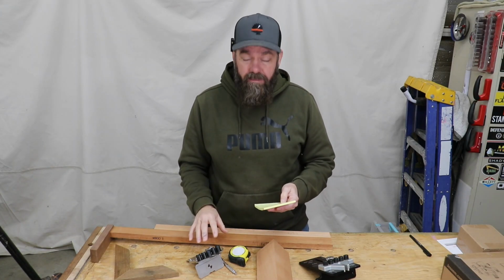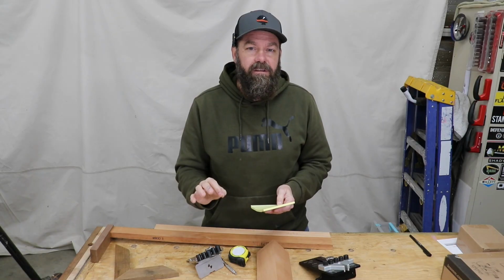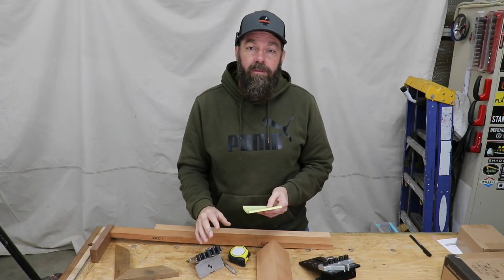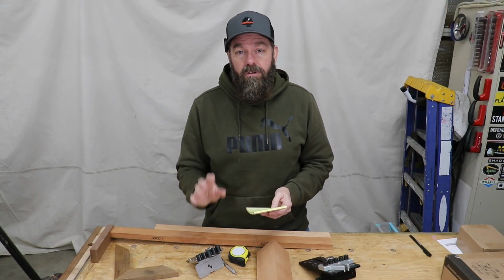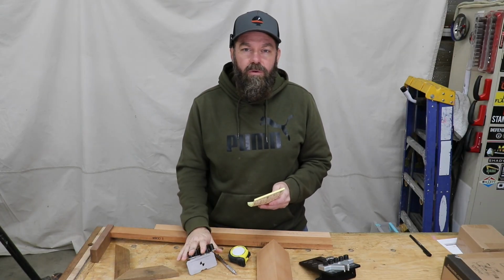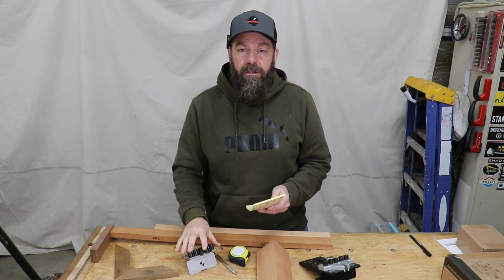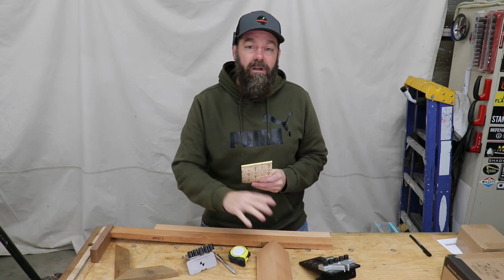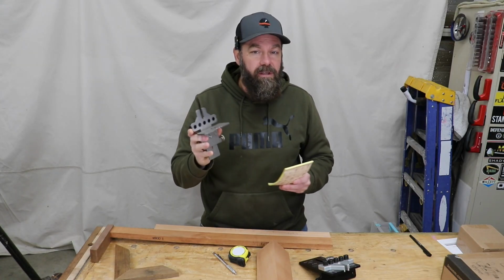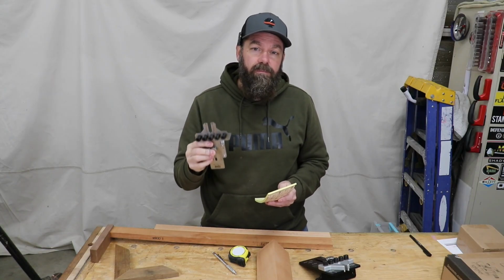As far as adjustment, it's pretty much a wash as far as doing it, but the new jig allows adjustments in 1/16 of an inch increments, whereas the old jig is 1/8 inch. So you get twice the adjustment in the new jig. So I've got to give adjustment to the new jig. I sure am saying jig a lot. As for alignment, I initially gave it to the new one, but I put a little question mark by it, and I wanted to revisit this after I used it. The alignment is quick and easy, just like the old master kit, and these extra alignment aids that this one comes with did come in handy. So alignment also I have to give to the new stainless steel jig.